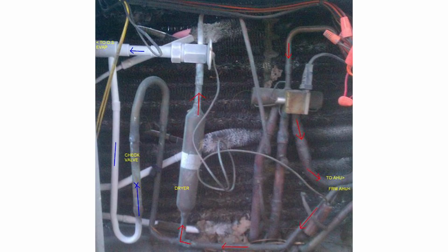It's a little bit larger than 3/8, right? They usually are 3/8, but it swells to 1/2 inch where the actual check valve is, but yes. They're not really that cool. They're really, really a big pain, because sometimes they stick, and that causes a whole other problem trying to diagnose. It's something very, very difficult. Yeah, whether or not the check valve is actually seating the way it's supposed to, or if it's not seating and bypassing the metering device.